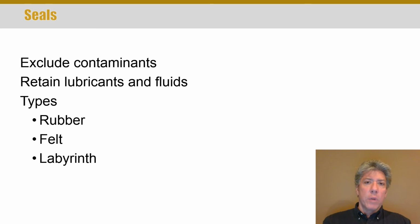And really the only thing you can do with seals is call a manufacturer. That's about all you can really do, unless you really dive in and know a particular area, because I guarantee there's sealing in some other area that you don't know about. So this is where you really have to have an applications engineer's help in the particular field where you're trying to seal. Now, if you buy a bearing, for example, the bearing will have seals on either side of it to keep grease in place and keep dirt out.